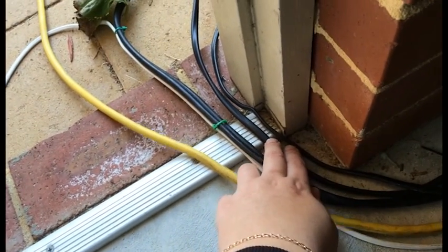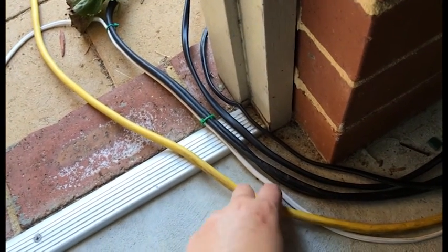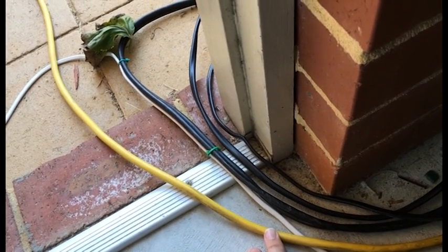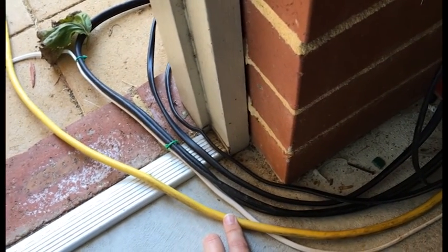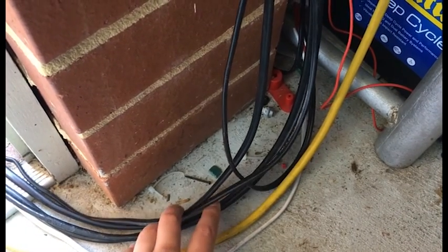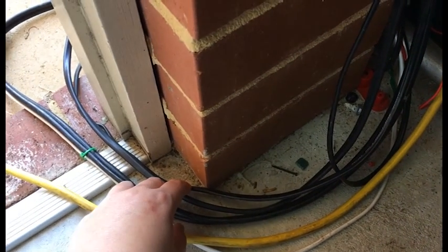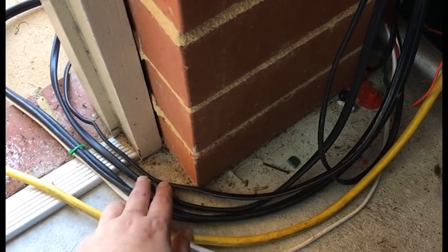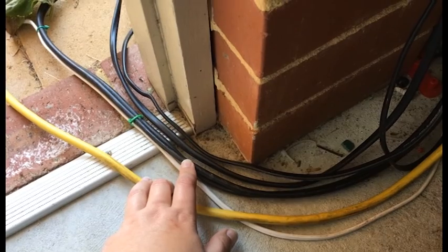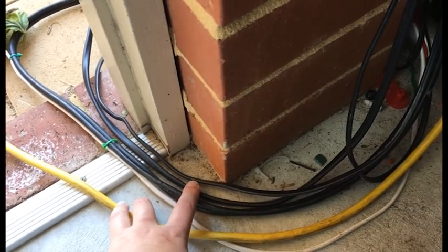This cable here is for my wind turbine. This white cable is my DC power that goes into my house. This yellow cable is the inverter feed to my house — or some items in my house. This other cable is the 190 watt first string, and this other string here is my 330 watt string. That one's 6mm; I think that one's 4mm — the wind turbine only puts out a maximum of 8 amps so it must be at least 10 amp rated cable.